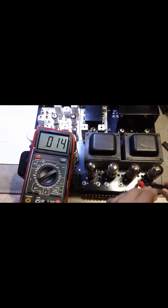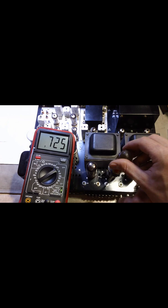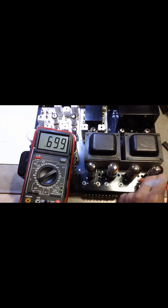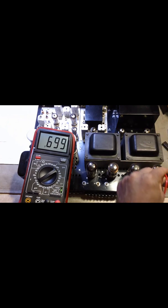So we go to the next one — TP5, all the way over here. As you can see, this one also is just a little high. Make sure you're on the right one — this is R10 actually, I'm doing R11. So let's leave it right there. And then let's go to TP6. That one's actually a little low since I just tweaked it accidentally. It's R11. 0.699 — that's pretty good.